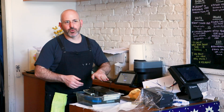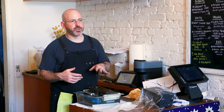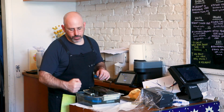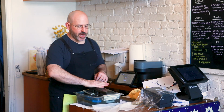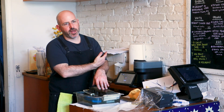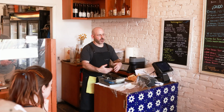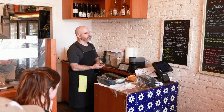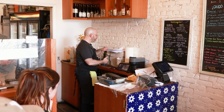And as much as possible, you want to use this hand for your back and forth motion. Both of the hands are going to have to be involved with it. But when you start involving this hand a lot more with it, people have a tendency to put a lot of strength into this arm, and they're either pressing down or lifting up, and it makes them not planar with the surface of the stone. So not only does applying pressure here keep you planar with the surface of the stone, but focusing on having your movement be based in this arm will also help you be more planar with the surface of the stone to achieve more consistent results as you go. So where you apply pressure also does matter.